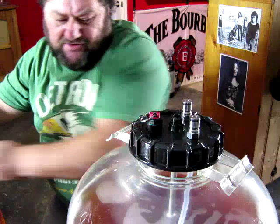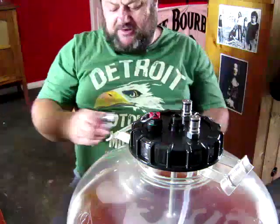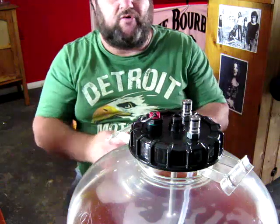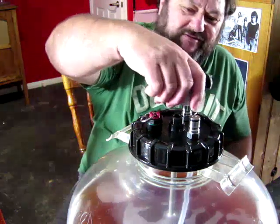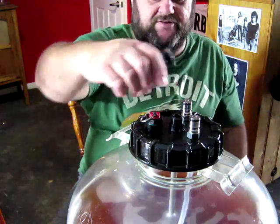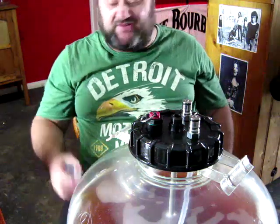And it is one thing you're going to learn to live with when you're playing with gas pressures, that they aren't exact. They are really ballpark numbers. These instruments, as good as they are, are not super accurate, and don't rely on them to be super accurate.